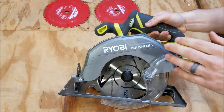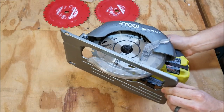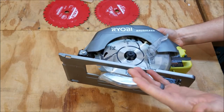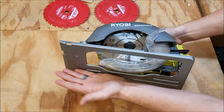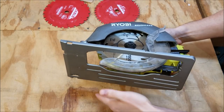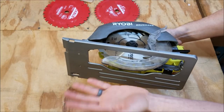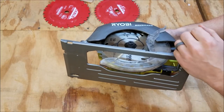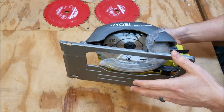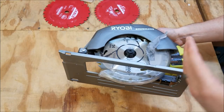Let's go over the features of this saw. The shoe is stamped thin steel — it is magnetic, so it's not aluminum or magnesium. It's fairly accurate. I took a premium level and measured it both horizontally and vertically to check for any bow, and there's a very slight couple-thousandths gap both ways on the shoe. So it's not perfectly flat, but that's what you get from a stamped shoe rather than a cast one, which is going to cost a lot more.